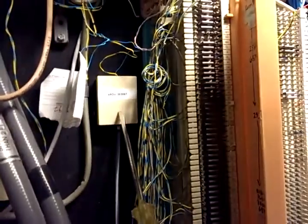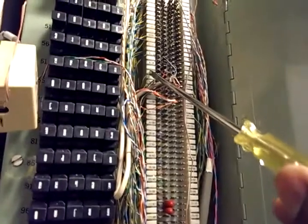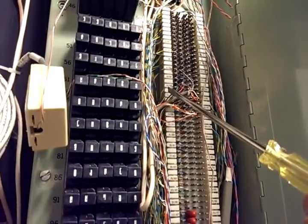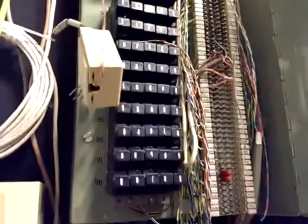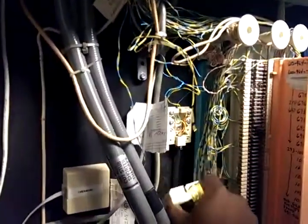The DSL circuit is this one over here, which we've terminated. We've got our cabling which goes up to our binding post at position number 10. I'm going to reverse the process so that you can have an idea of how we got to this point. The first thing is I'm going to remove this jack and zoom in a little bit more so you can see the positions.